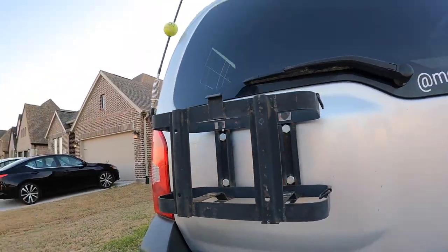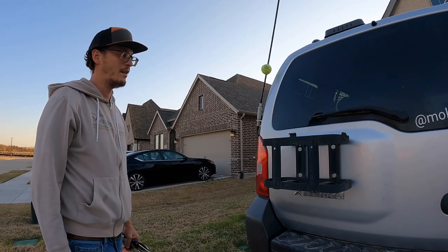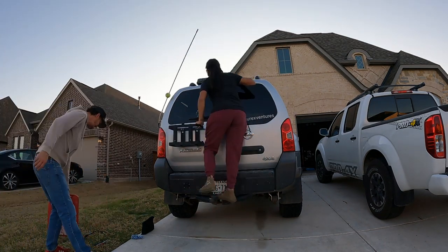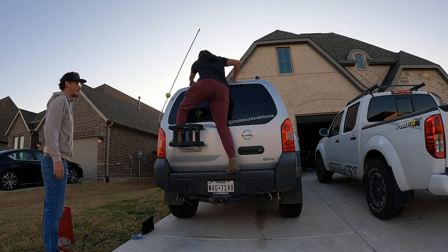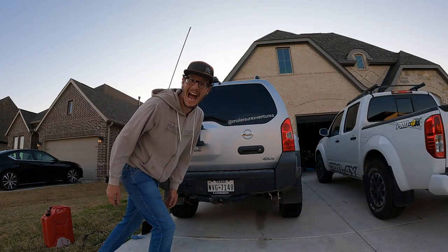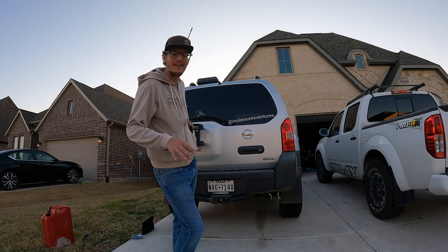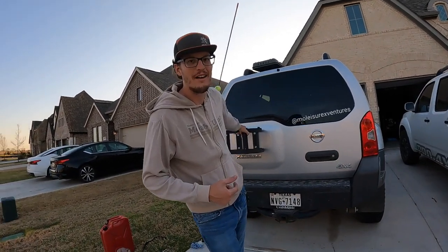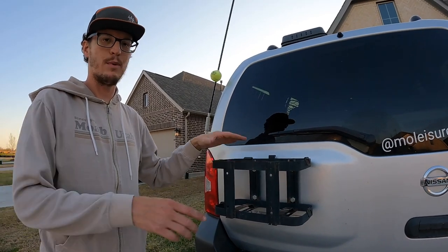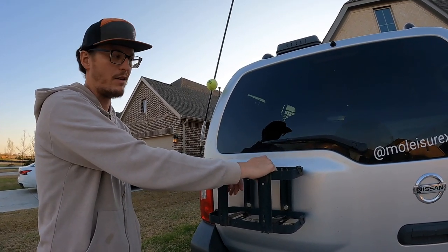You can put quite a bit of weight on there. Can I stand on it? Probably, yeah, actually — I wouldn't be concerned about you standing on it. That is the reason I put those fender washers on there: with the fender washers on both sides, on the metal and the plastic, that allows all that weight to distribute over all the space of the fender washers. And that's how it's able to carry so much, even though this is sheet metal.